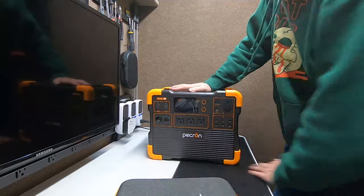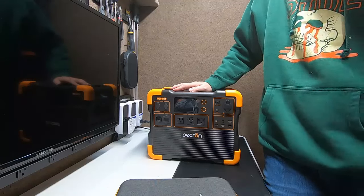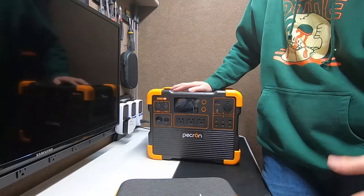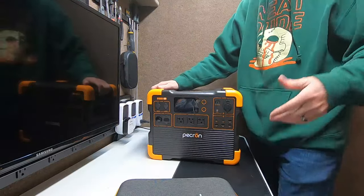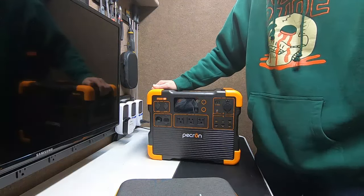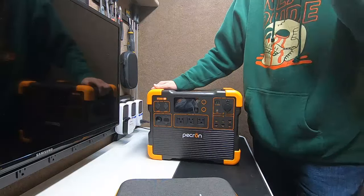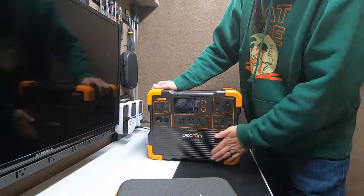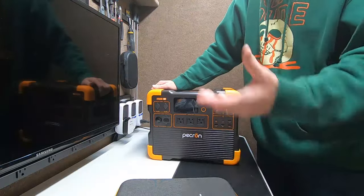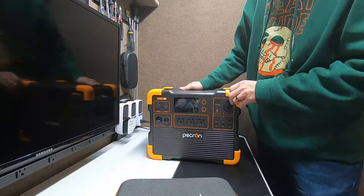The batteries are the same, guys, so you've got 60-some pounds on the batteries each. It's 3,072 watt-hours on each battery. You can't really shorten that. A battery is a battery unless you change the chemistry of the battery. So lithium iron phosphate batteries is what they are, 3,500 cycles to 80%. The weight of the battery is what it is. The only other way you can maybe make the system lighter is to change some of the features or the options, the inverters and things like that. But I don't want them to get cheap on us here.